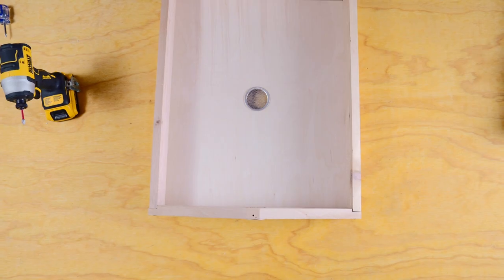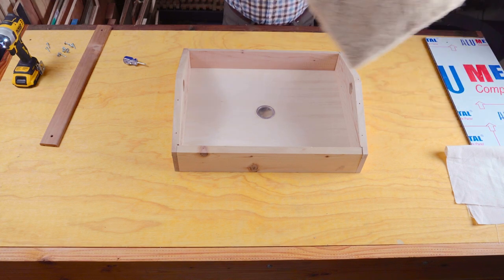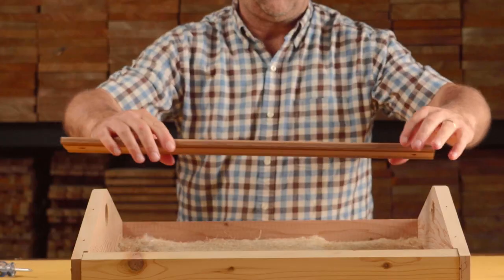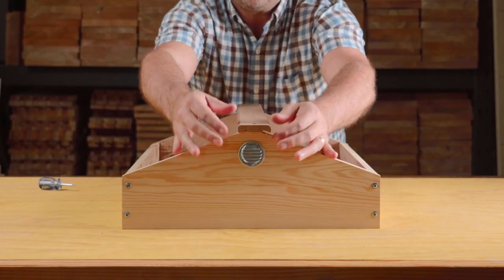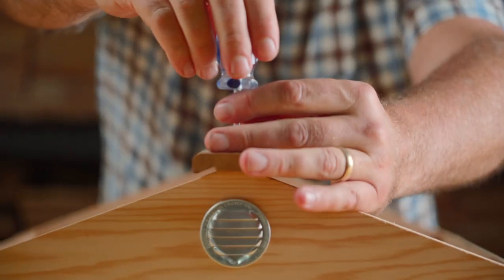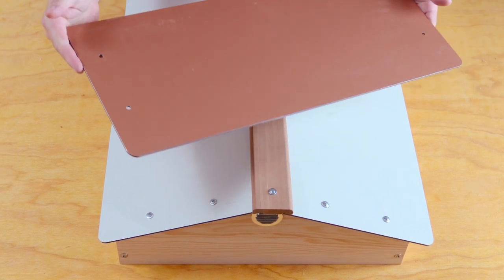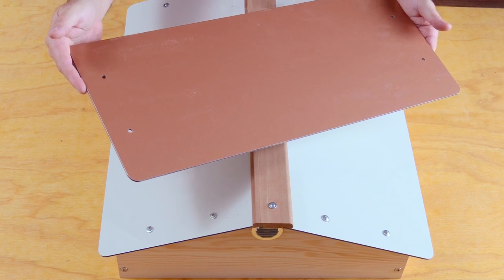After oiling or painting, allow the coating to dry completely before proceeding. Place the hemp insulation in the box. There may be multiple pieces. The hemp should be snug on all sides. Add the ridge cap and carefully screw the ridge cap onto the top of the ends with two of the smaller screws, making sure to center the ridge cap and finishing the screw by hand. We think the copper and white sides of the aluminum panels are great colors for roofs in winter and summer. But if you want to paint your aluminum panels, now is the time.